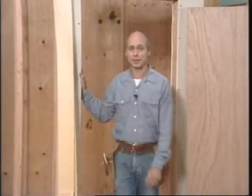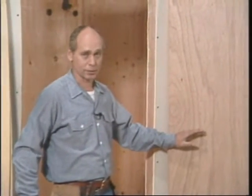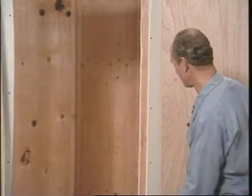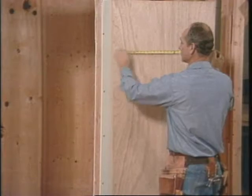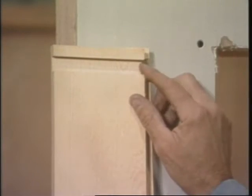Here we are back on the inside of the house. This is the two-by-four wall with half-inch drywall on the sides. This is a jamb set and the hollow-core interior door. A lot of people use pre-hung doors, and so do I, but I'd rather hang them in place. When I do that, I have to keep the time up and use all the shortcuts I can. The first thing you need to do is measure the door — this one is 30 inches. It's important to do that because a lot of them come downsized from the factory. Next is to cut the head, and I'll cut it 30 inches long plus the depth of the two dados.